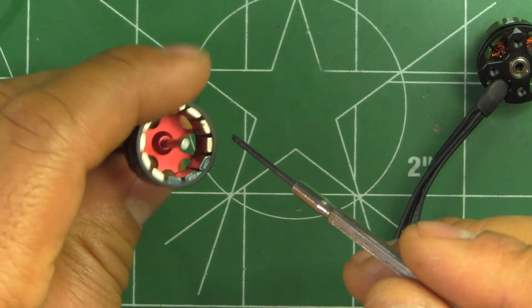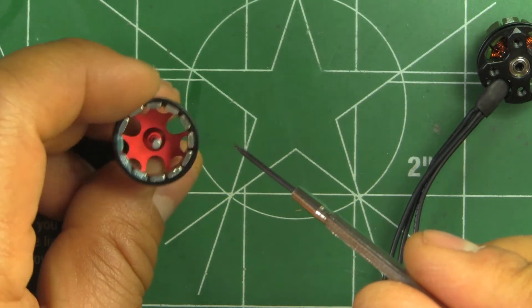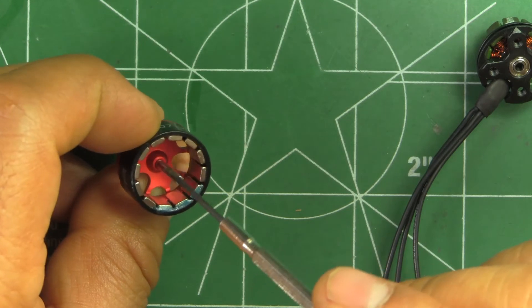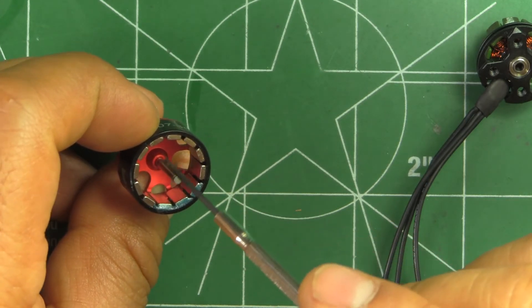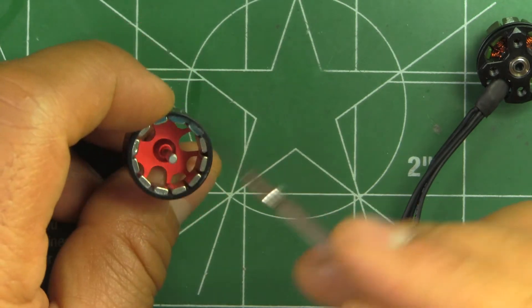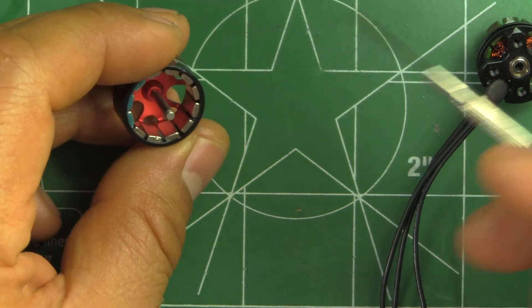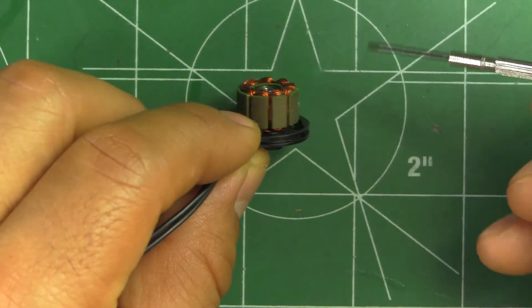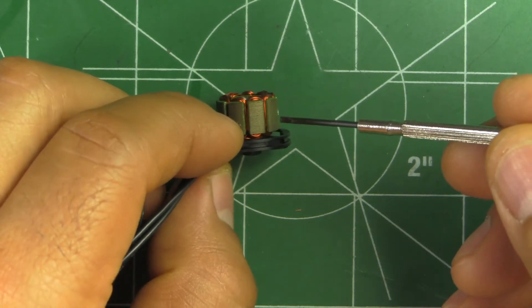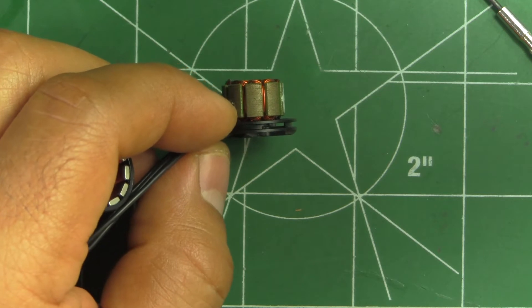As you can see, the magnets are not arc magnets — they are square magnets. But for this size motor, because the magnets are so narrow, arc magnets would be better, but I don't think that's going to cause that much of a disadvantage in performance. Looks like the laminations are 0.2 millimeters. I didn't have time to count how many there are, but they certainly look very close to 0.2 millimeters.